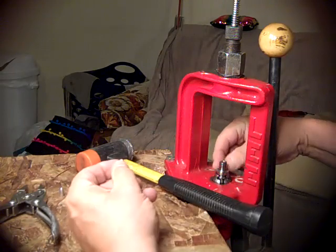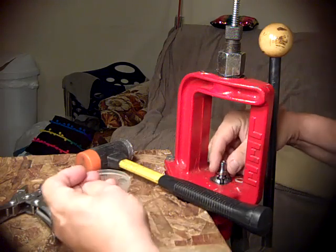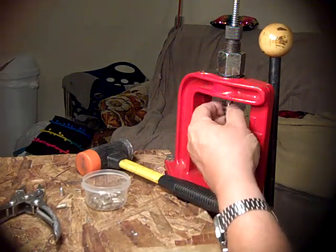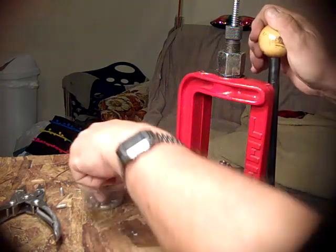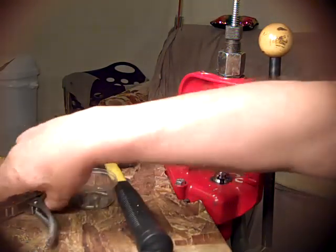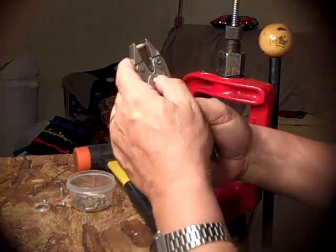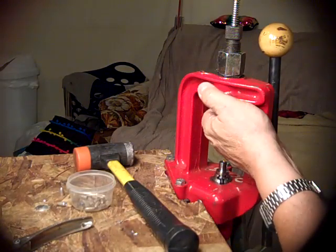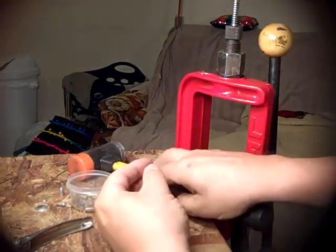Now, these dies have to be made to fit exactly. So I'll show you what I got here. This die up on top has got a receiving area to receive this, to guide it to center. Otherwise, these guys would be off center, and they wouldn't be any good at all. Yeah, these are all going to be small. So with the mold the way I have it now, maybe 20-30% are too small. I got to go through and expand those holes again a little bit, make them a little bit bigger, and everything has to match.